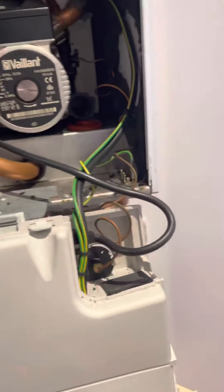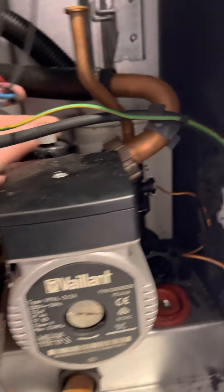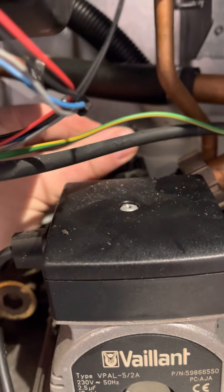Clip it back on. As soon as you put your isolator valve back on, it'll hiss and bang and do all its job — the automatic air vent. Make sure you've got no water on it, it's just not leaking. Tighten it all the way down, tighten two back, put the front back on.